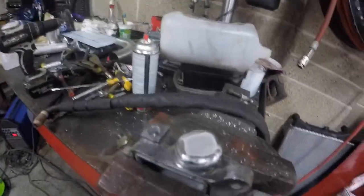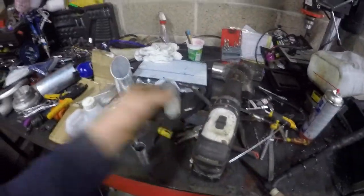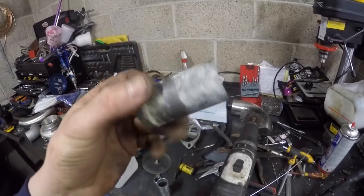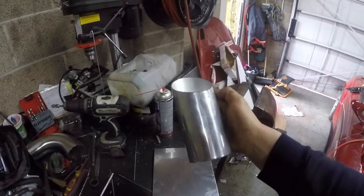So I'll weld up the stock outlet now. Looking back at it now, I wish I never used that cast piece because the weld on it is hideous — really porous. It was just the worst cast, it was bringing everything through, bubbling and fluttering and all sorts. But that's on anyway. I'm kind of hoping you don't see all this dodginess on the new camera.